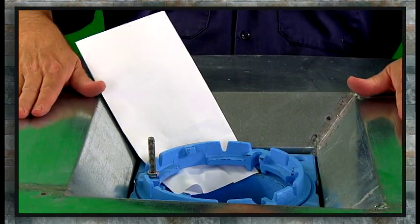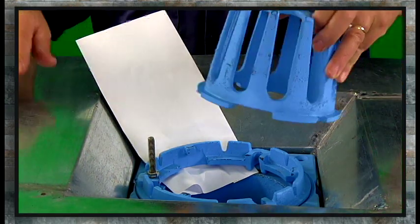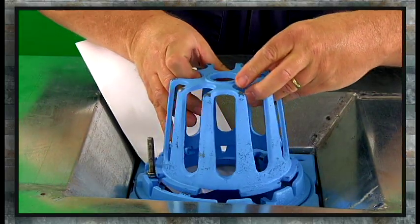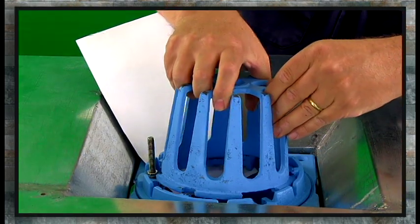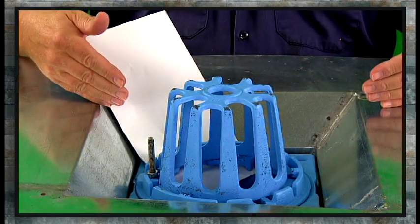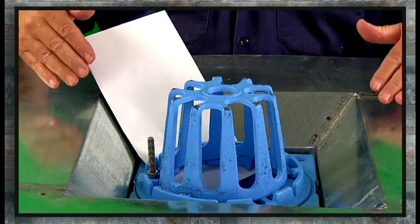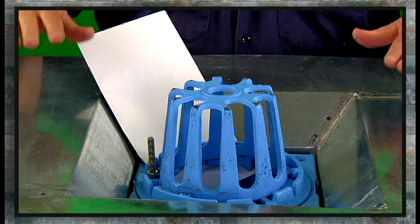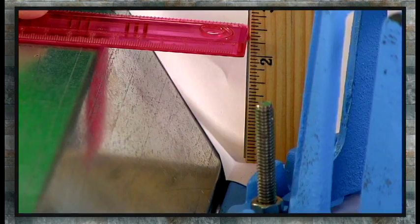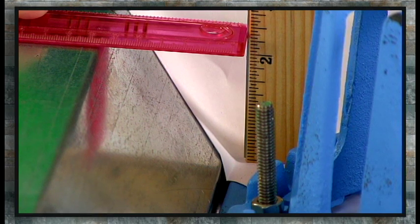This step must be done by a qualified roofing contractor. The final step: take the leaf grate — this will also probably be done by your roofing contractor — and install your leaf grate. There you have a roof drain that sits two inches below the deck, which is what makes this a unique product and which will allow your flat roof to actually drain away the rainwater. The fact that this roof drain, when completely installed, is still two inches below the roof deck is the single factor that makes this system so effective in draining away the standing rainwater off of your flat roof.